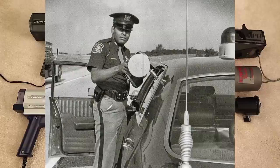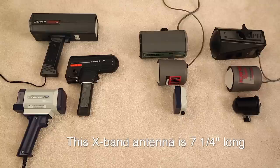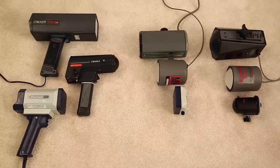This X-band antenna is not the oldest version since it has the lens to shorten it — I think it's about seven-point-something inches. Moving from X-band to K-band: higher frequency means shorter wavelength, so you can design the antenna more compactly. And then moving to KA-band: again higher frequency, shorter wavelength, even more compact antenna. So X-band is largest, K-band is more compact, and KA-band is smallest.